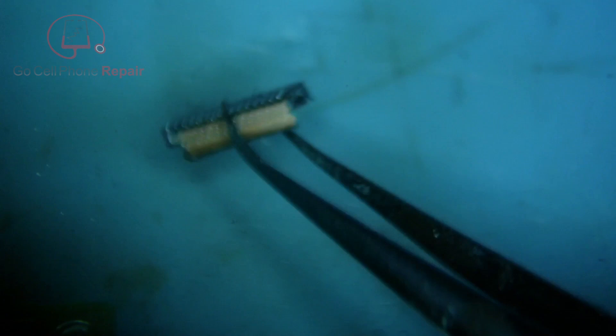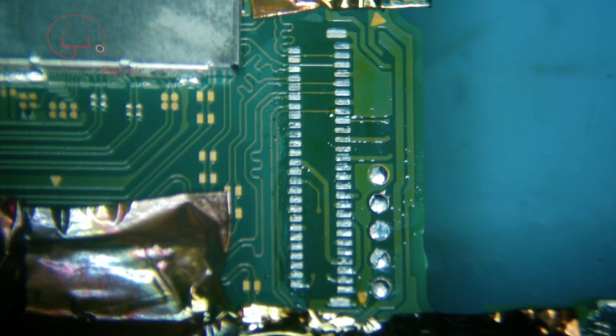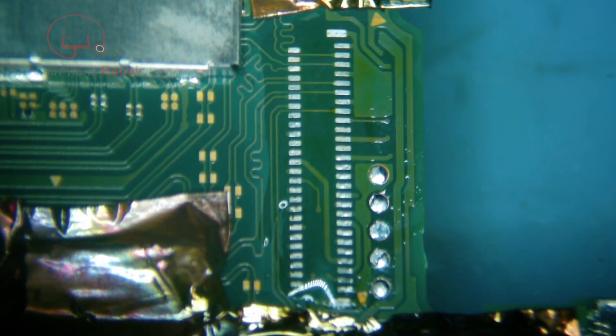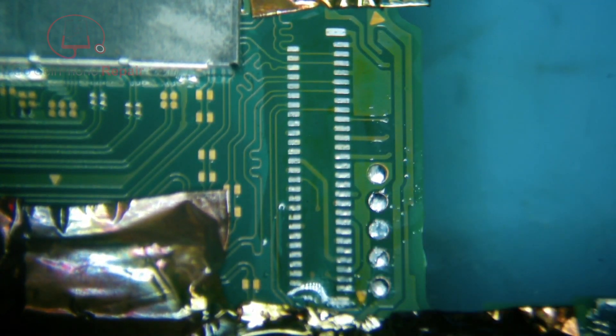But no problem - we've got the old solder off of the pads, so we'll get some lead on here to make things easier. Probably a little more flux. These boards just dissipate the heat very efficiently, so they don't stay warm for too long. Actually, I am going to do this a little differently, because if you put the solder down now this new connector is not going to sit flush on the board. It becomes a challenge to kind of push it down because you really can't use the hot air, even with the leaded solder, at least in my most recent experience.